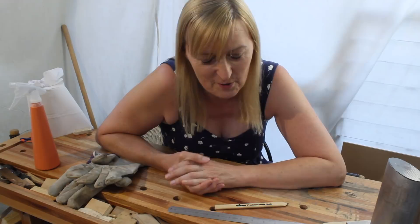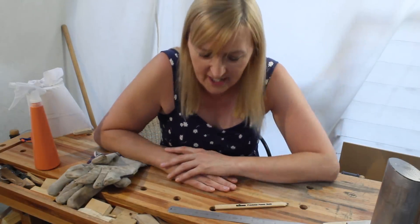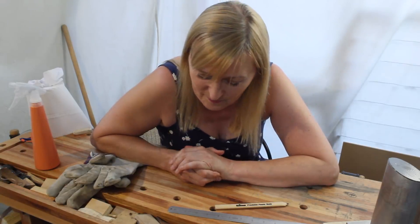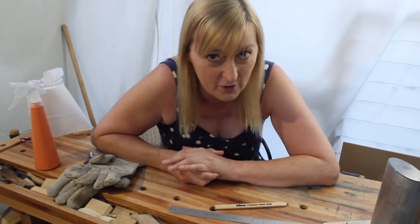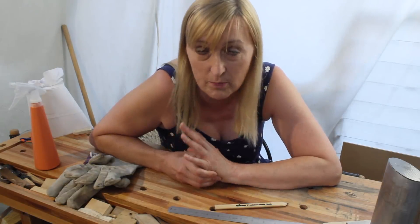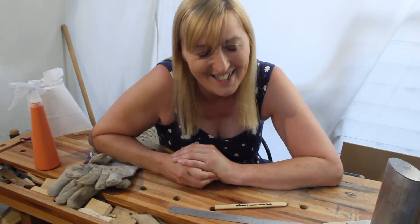When I came back to finish cutting the sides to width — after the sides had settled down, the warping had gone, and they were nice and straight again — I was going to cut them one at a time. I opened up the bandsaw to find that the tyre had come off the wheel. Part of the blame could have been the heat, as it was very hot in here and the rubber may have softened. But the rubber had degraded — it had perished, gone hard, and was starting to crack. This had actually happened to the bottom wheel previously.